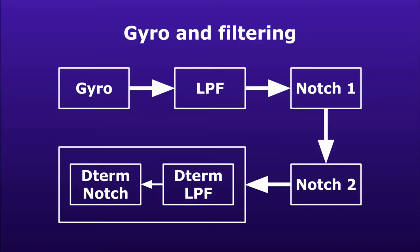Second, there is a software-based low pass filter located in the flight controller itself. Its main role is to attenuate frequencies above the cutoff frequency, but practically this does not work very well. This is why some time ago two additional filters were introduced in Betaflight and Cleanflight — called notch filters, notch filter number one and notch filter number two. The gyroscope signal ends filtering here, but this is not all — the PID controller internally also filters the D-term with a low pass filter and a notch filter.